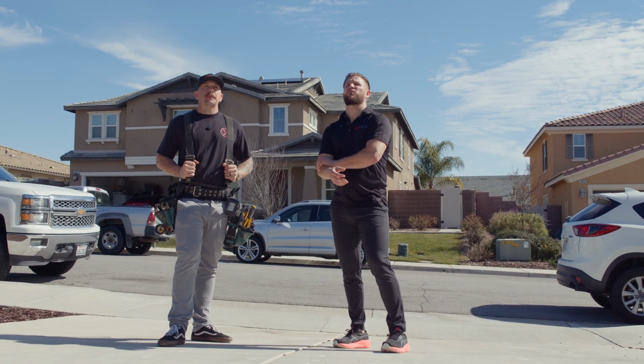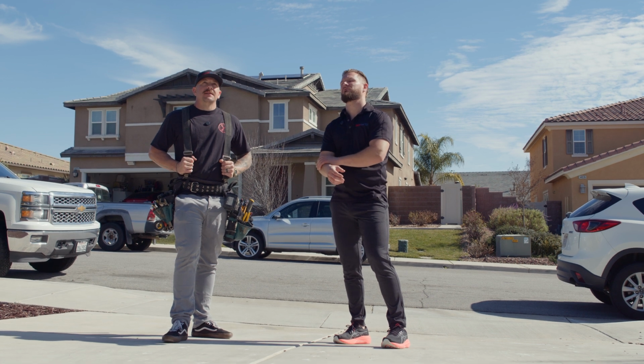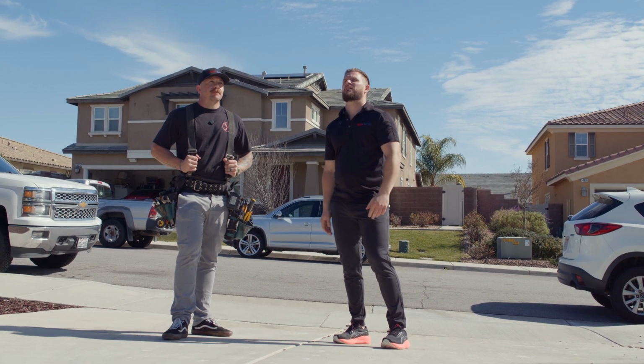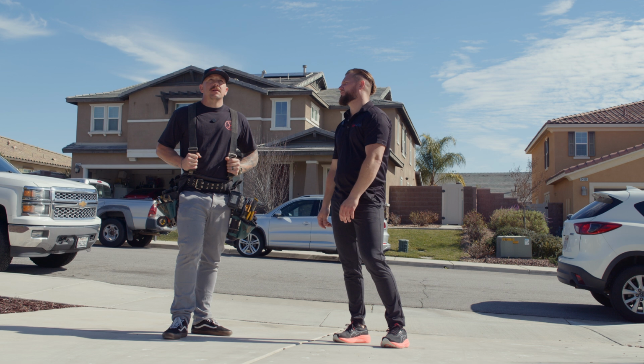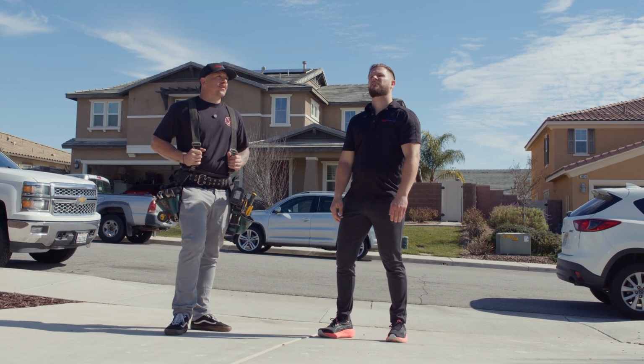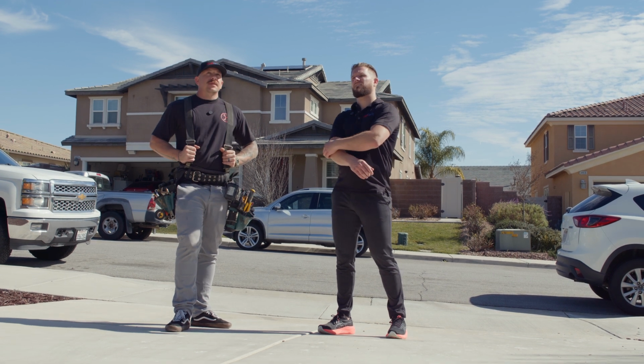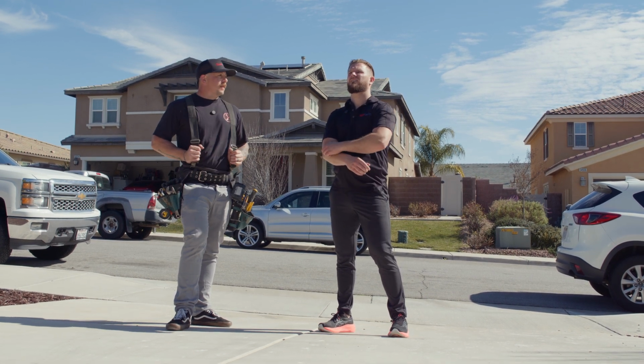What happens if we're in a home where we don't have as many vents as we currently do? What if it's undervented to a certain extent for the system that we're installing? What do we do, and how do we proceed? A fan will work when an attic is underventilated. You're just not going to get the most benefit out of it. You can still run a fan on low or medium if it's underventilated.